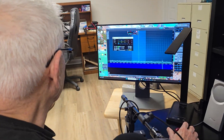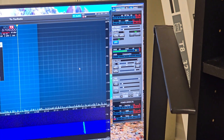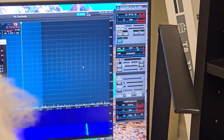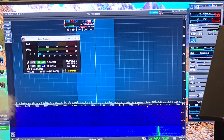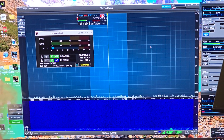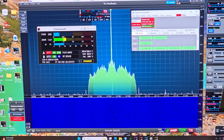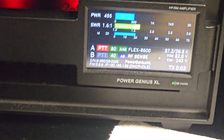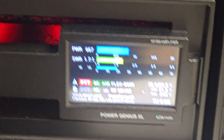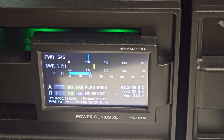So I'm going to go to dummy load and I'll show you now. I've got the mic meter active. When I'm in receiving, I can watch that. I have the space bar configured with this program here, FR Stack, that they make to go along with this. Testing, one, two, three, four, five. Hello Radio. About 250 watts a carrier.